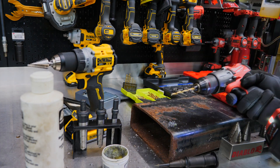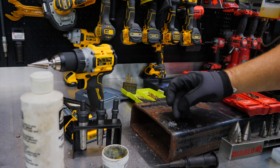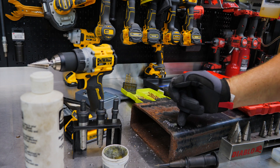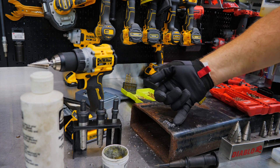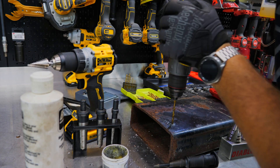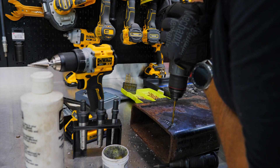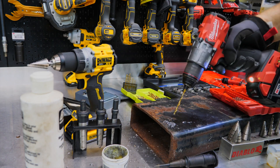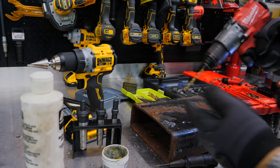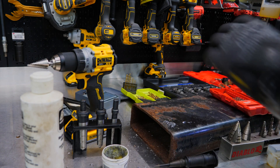Using this cheap Ryobi drill bit to cut thick steel — I'm getting some decent chunks but not big spirals, so this drill bit is definitely not the best but it will make the cut even in thick steel. I want to make sure I've got enough pressure that I'm getting chips and not dust. And you see I drilled through there with not a lot of problem at all.